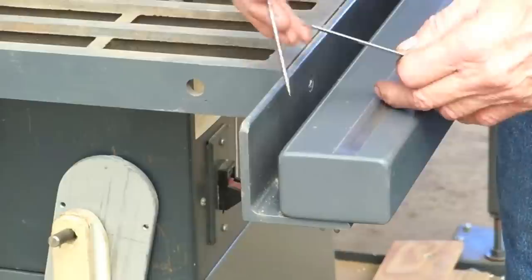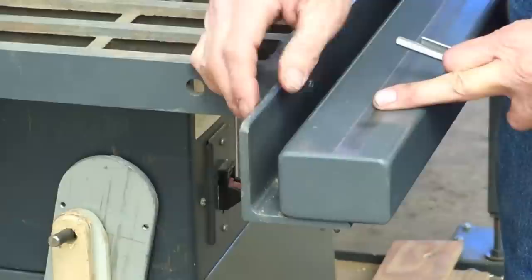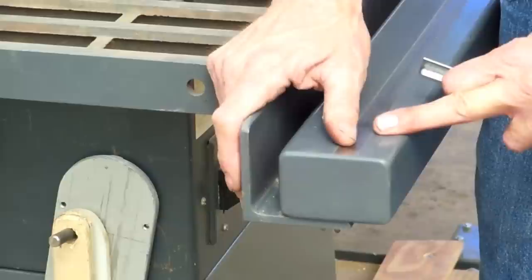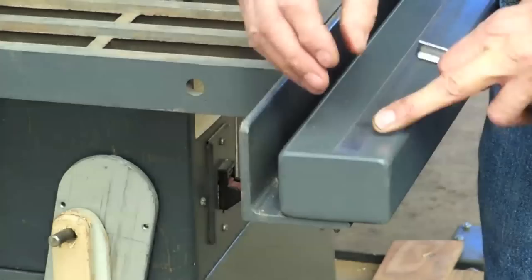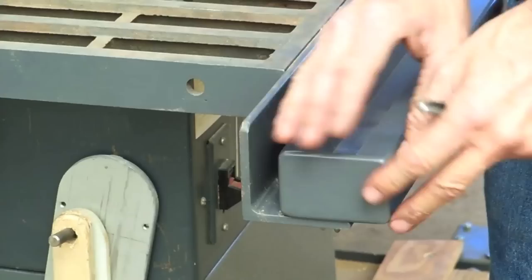Now, you'll notice in this video that I use a milling machine to put slots in the angle iron and then thread the tubing. If you don't have a milling machine and don't have that capability, we will be using 1/4 inch by 20 bolts to mount this with. You'll pre-drill at 1 foot intervals with a number 7 bit, which is the threading size for 1/4 20. After you have all that drilled and tapped, you go back and re-drill the angle iron with a 5/16 bit. That will give you enough opening to allow you to move this tubing back and forth and adjust it.